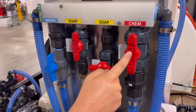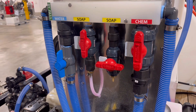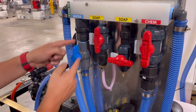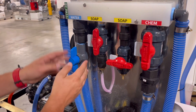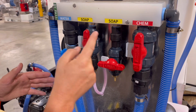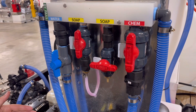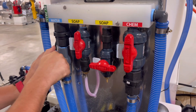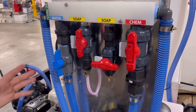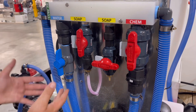But you've got metering here and no metering here on the water. So when this pump is running — this is a gas pump, I'm not a huge fan of them either, but that's besides the point — when this pump is running and it's sucking through this assembly, it's going to suck a lot more flow right here because there's nothing inside this regular old ball valve to restrict that flow. When we build a system we put metering valves on everything. Not that we really need to meter the water, but we do need uniformity in the system. From a design perspective, that's a little bit of an issue. You can kind of work around that by throttling the valve back, but it's never going to be accurate like you want it to be. And guys, it's a hundred, maybe 150 bucks more to do it right. This is an expensive system — just do it right.